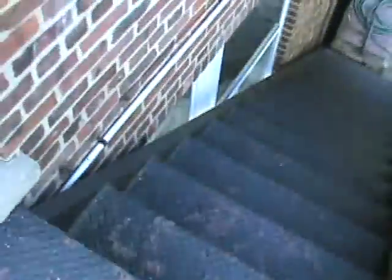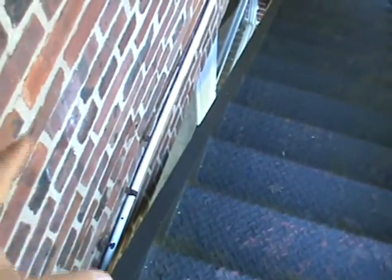There's a railing missing on the top one and on this one. Same thing. If you were to fall, you need a left side rail, similar to the one on the right side, basically to stop you from falling in through and onto this window area here. That can be just 2 lines or 3 lines, but you need something to grab onto on this side, just to keep people from falling anywhere near this window.